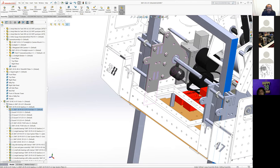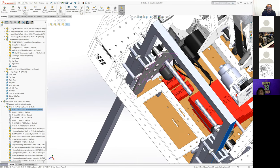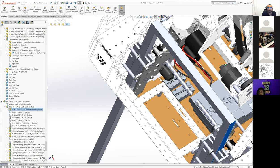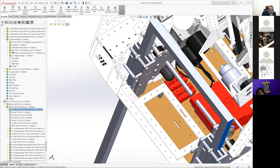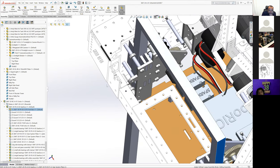Early on when we had first decided to do a buddy climb, we were thinking of just doing a simple latch mechanism. When the forks would be up in the belly pan, they would be held by two latches on both sides. Then a pneumatic would push the latch down and the forks would drop once we were climbed. Soon we realized there were better ways to do this, so we modeled this after 971's 2019 climber. That's correct, because they used forks to push themselves up onto Hab 3 and then they could pull the forks up and drive on. But we mainly used their belt system.